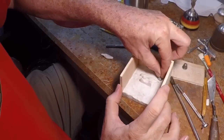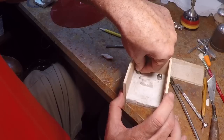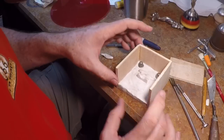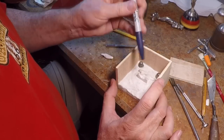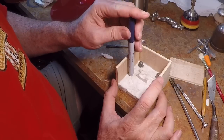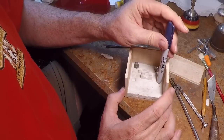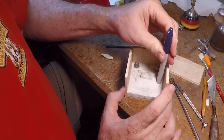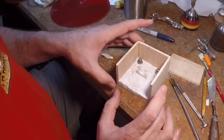I'm pushing in my acorn nuts — these make excellent registration points when putting the two parts of the mold together. I'll put those in, then add a couple of dimples on the side that are the negative of those. That gives me four registration points to help align the two halves of this mold as precisely as possible.